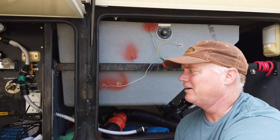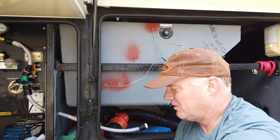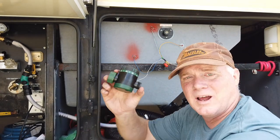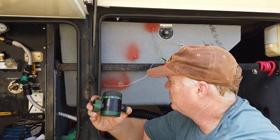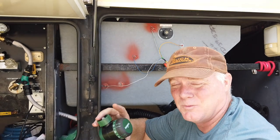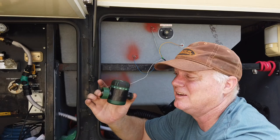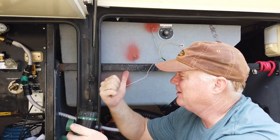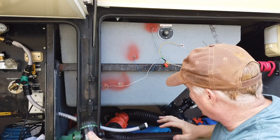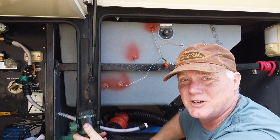Here in the black tank area, you can see where the hose comes through. We're going to add a couple of things onto the end of this hose. We're going to attach this water sprinkler timer to this hose. Why would I attach a sprinkler timer to the hose going into my black tank flush? If you've ever forgotten to leave your black tank flush on, walked away, and the black tank filled up and flooded your RV with nastiness - you'll know why. I can turn it on for about eight minutes; eight minutes won't overflow the black tank. If I've left my black tank valve closed, it won't overflow into the RV - it'll just shut off and I'll have a full black tank. It's just a safety measure.